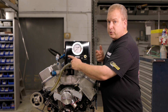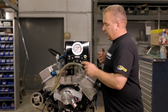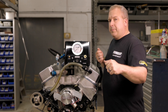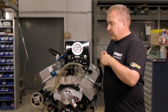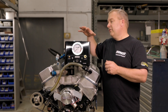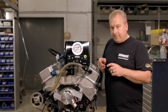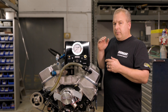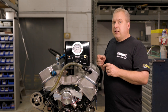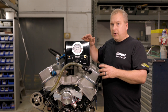This is coming in from your air source, whether it's your air compressor in your house or your shop — that plugs in here. Coming out of here is going to be that three-foot hose that's ultimately going to be in your hands. So when the whip hose is in the engine, you connect it up and now we're going to get our reading based on where this needle goes. These boxes are all individually calibrated here at Moroso Performance in Guilford, Connecticut. Whether you have it for a month or 20 years, you can send it back to us and we can recalibrate it within half a percent. That's what makes this one of the best units on the market.